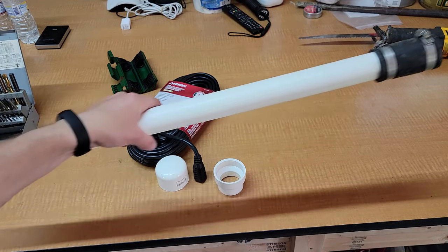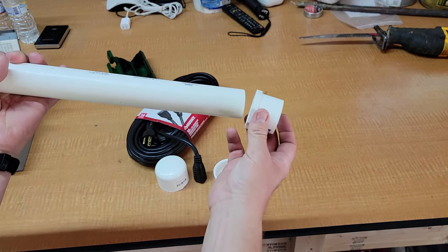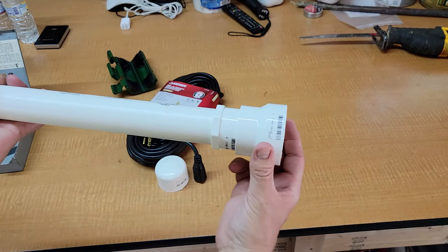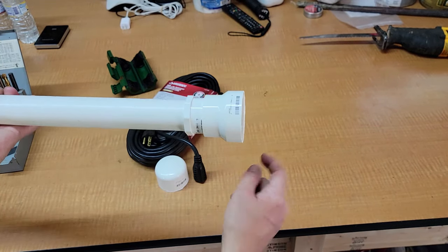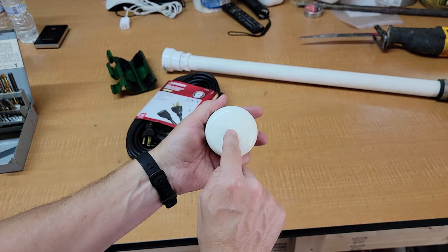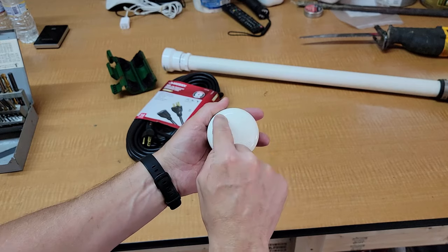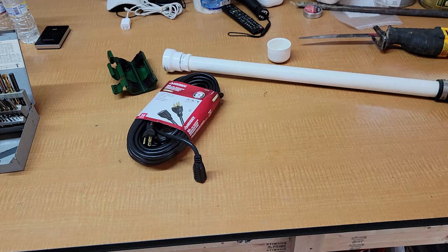The pipe connects to an inch-and-a-quarter PVC pipe on the sump pump. I'm then using a fitting to go from an inch-and-a-quarter to an inch-and-a-half, then from an inch-and-a-half to two inches. I put a two-inch piece of PVC in there and cap it — I'm actually going to drill into the cap. This was one of my first changes; I didn't like the spray pattern, so stick around to check out what I actually did after this.